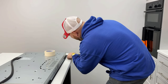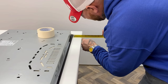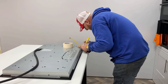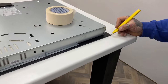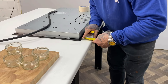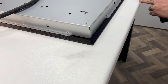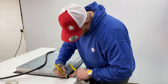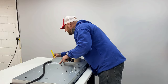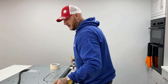Then we're going to mark 70mm — I'm putting the tape up against that edge and 70mm is going to be the flush line. I've got a bull-nose edge on the worktop so it's a little bit difficult, but that 70mm runs alongside there. Mark both corners — inside and outside — and then transfer to make sure we're square, going 70mm again to verify it's square to the front of the worktop.